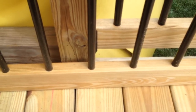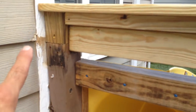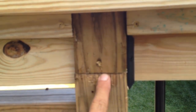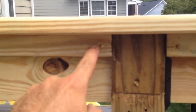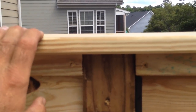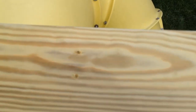Now that's sitting right on the ground. Obviously we can't build it that way because we've got to have a minimum of three and a half to four inches clearance at the bottom. So outside of destroying and trying to take this whole thing off, all I did was block it. Put glue on the inside, a couple screws. And then when I tied my two-by-four in here and then put my deck board up here — the final trim piece for the handrail, the top rail — it tied it all in.